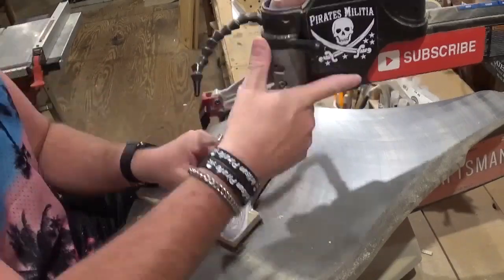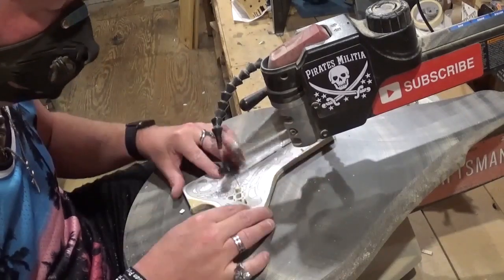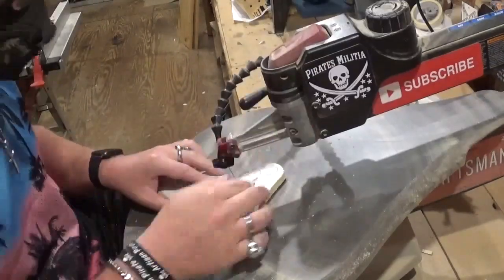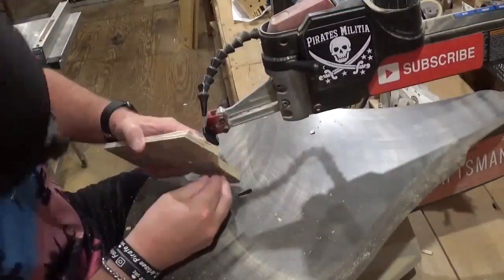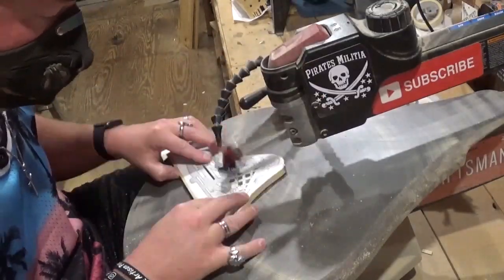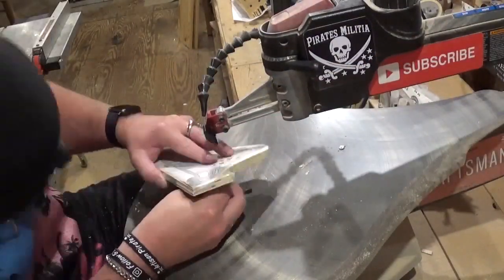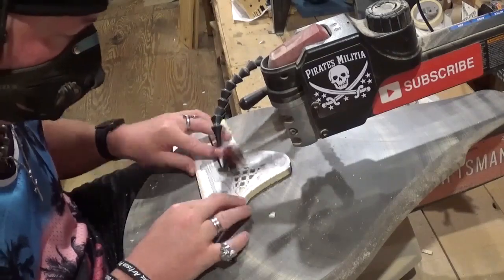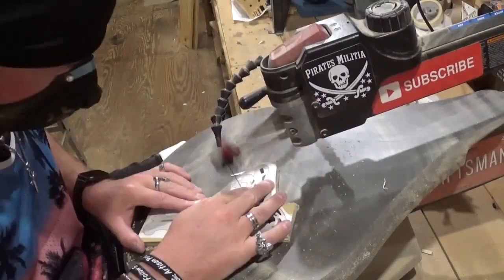The number five ultra reverse tooth blade will cut through all the material exceptionally well with minimal chip-out, which is always good when it comes to sanding. We're beginning with the stacked cut pieces that are the brackets, cutting both out at the same time to make sure they are symmetrical. The blade handles stack cutting as well as the single layers of quarter-inch material we'll cut later.